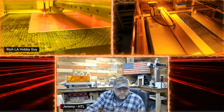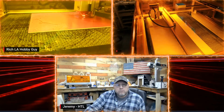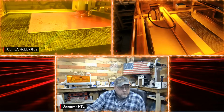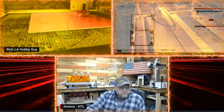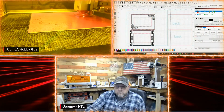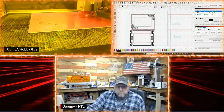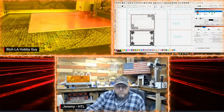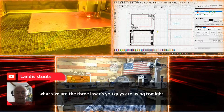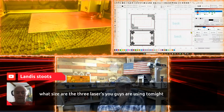And it looks like my cuts are doing well, even though that's spray painted. That's good to see. Everything looks like it's dropping out. I'm going to flip back over to my Lightburn screen. Folks, I forgot to change my fill settings to offset fill, because if these were done in offset fill, they'd have probably been getting close to done by now. So I think what I'm going to do is, once it finishes this bottom one, stop it and then run the top one in offset fill.